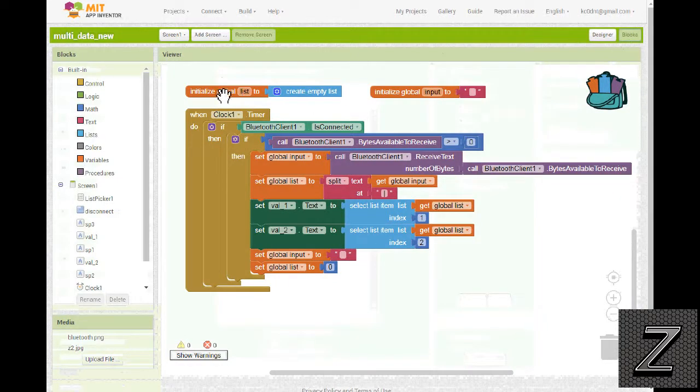A good rate is five seconds for the Arduino sketch and two seconds for the app — you can change that by clicking on the clock. Back in the blocks: we're initializing a global variable and making a list. When the clock timer fires, it checks if Bluetooth is connected — if it's not, it skips this step, otherwise the app will glitch. If bytes are available to receive, we set the global variable by pulling in that full line of data containing the temperature, Celsius unit, humidity, and percentage sign.